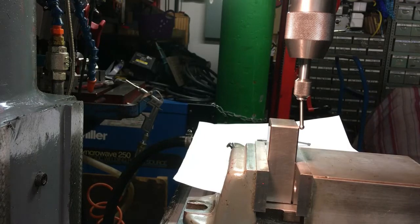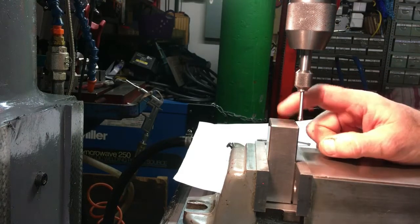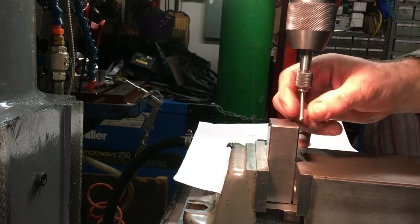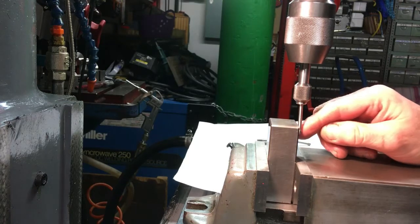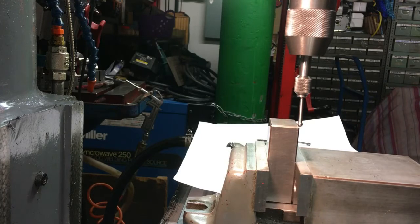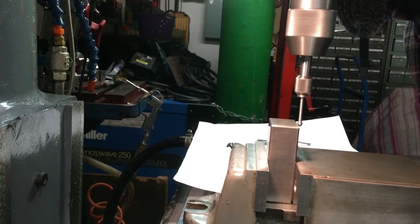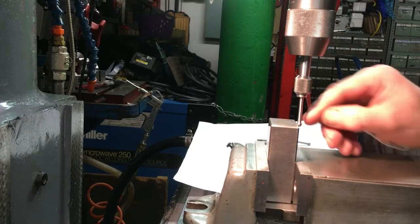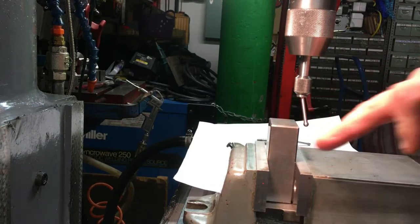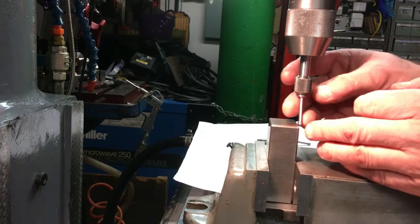The reason I don't like these as much as the cylindrical ones is that sometimes with a workpiece, the ball can flick out and spin around, and if it's down on top of the work it can actually damage the workpiece. Be aware that you want them down reasonably low so that when they flick off they only rub up here. This material might be slightly magnetic since I use it on a magnetic base, so it's not demonstrating perfectly, but be aware they can flick up and cause damage.